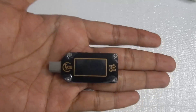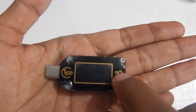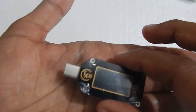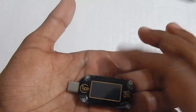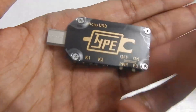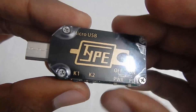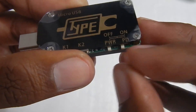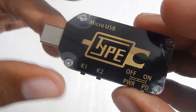As far as the physical overview is concerned, this is your male USB-C port and this is your female USB-C port. On the front you can see bi-directional arrows — one going right and the other going left — meaning this meter can measure the flow of power in either direction, which is helpful in many situations. At the back there are two click switches and two sliding switches. The K1 and K2 switches are for navigating through different menus and selecting different settings. On the right side you have two sliding switches you can slide off and on.